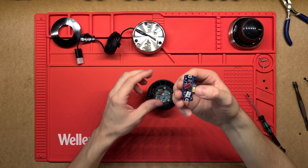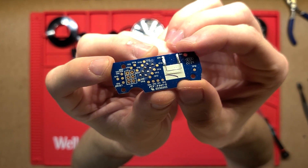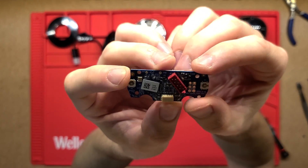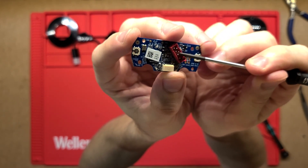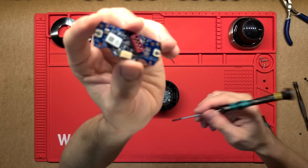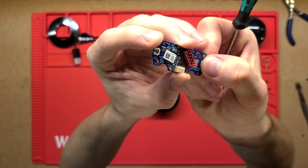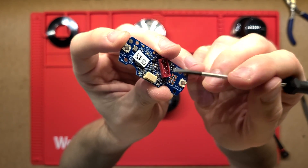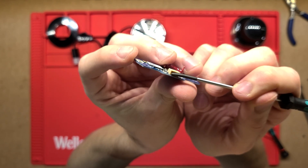That just pops right off and we've got this PCB here. On one side there are just exposed contacts and the grounding contact. On the other side, that red bit is a pin-and-socket connector that connects to more boards underneath. On each side we've got these tactile buttons — quite little buttons that get pressed — one on each side. Then we've got the actual connector for the USB cable that provides power and communications.